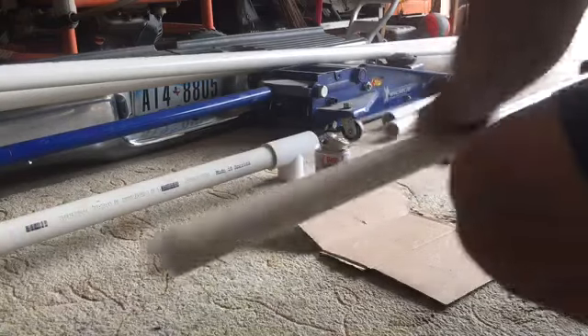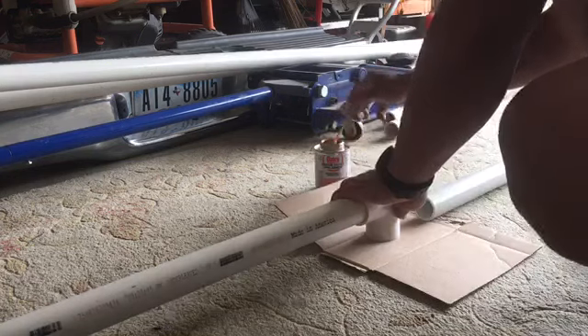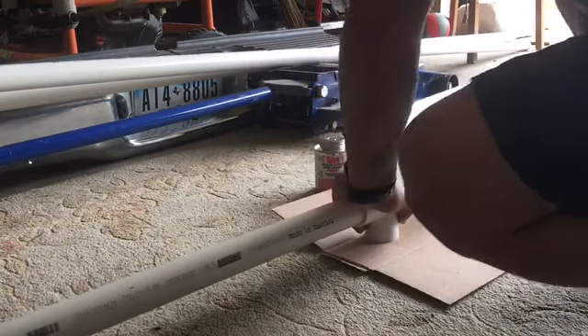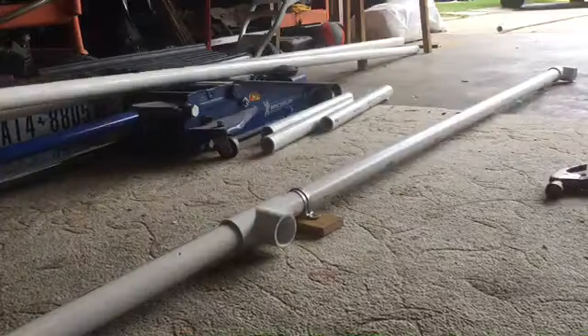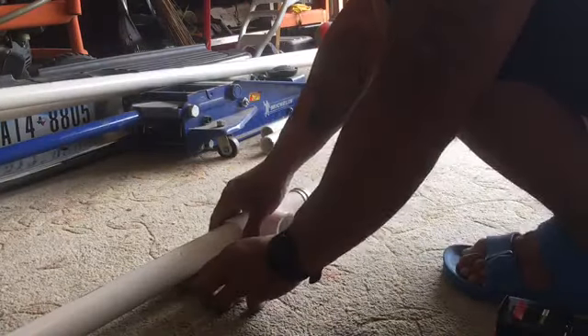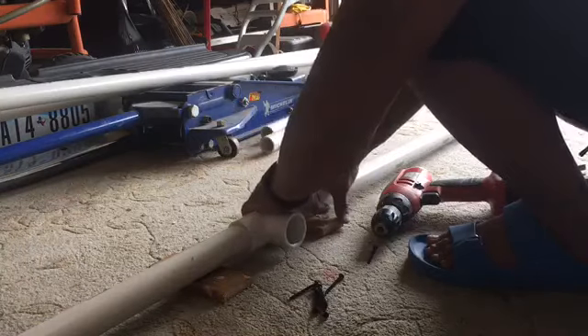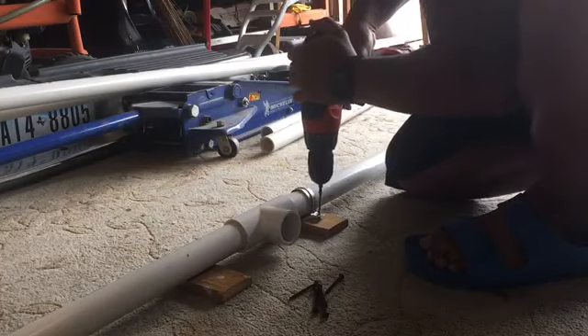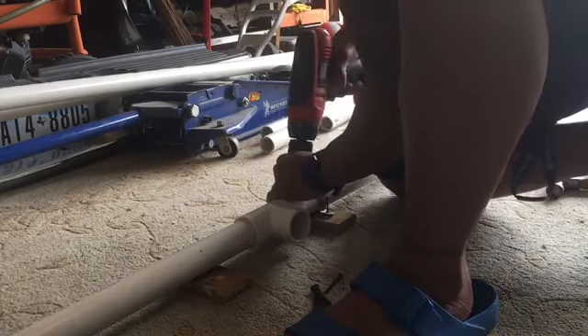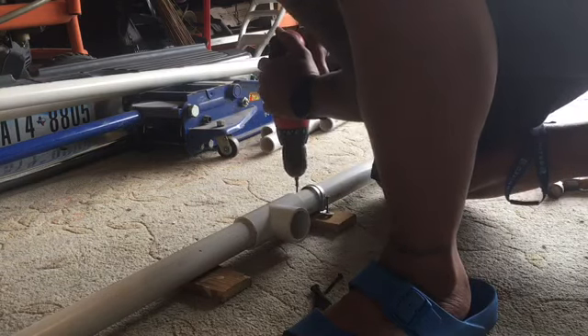Make sure that side is laid on the floor correctly so that when you connect it, it's even. Now what you want to do is pre-drill your spacer and your wall mount — make sure it's centered. All pre-drilled: middle bracket to middle bracket, one on each side.